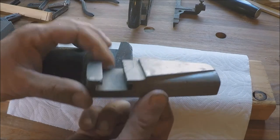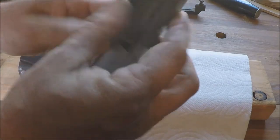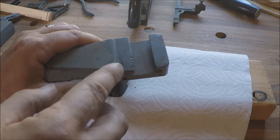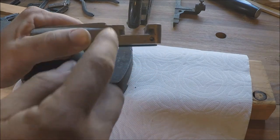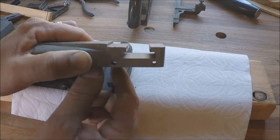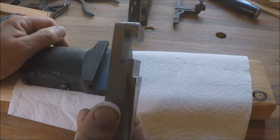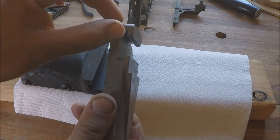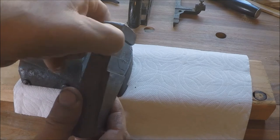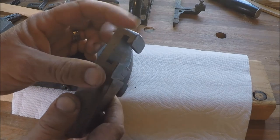Same is true with this one here. Now, this little slide — boy, this thing has really had a rough life. Everything's good here on the backside and underneath, but right here it's been broken off. There's a big crack where they cracked the T out of it, and then they held it in there somehow and drilled and put screws in it to hold it in position. The front — all the way across here — this whole piece has been snapped off. And I guess this is a very typical failure for this, because this is not very thick. It's undercut right here and there is not a lot of meat in this area — it can't be more than an eighth of an inch. So this is not a very strong casting in that part.